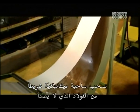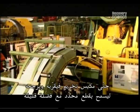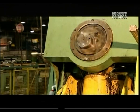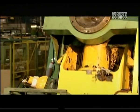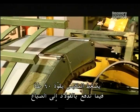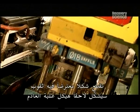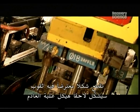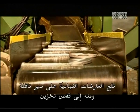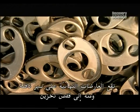To make an exhaust system, a mechanical puller draws a stainless steel strip up into a punch press, shuffling it back and forth to allow for a precise cut with little waste. The press brings 60 tonnes of force to bear as it pushes the steel into a die, punching out a baffle shape with holes in it which will form the skeleton for the exhaust box. The finished baffles fall onto a conveyor belt and go into a storage cage.